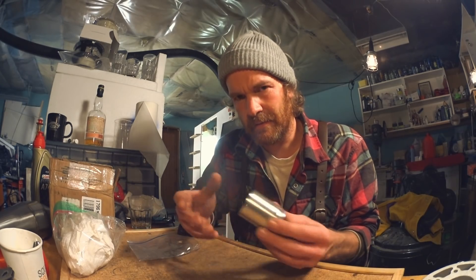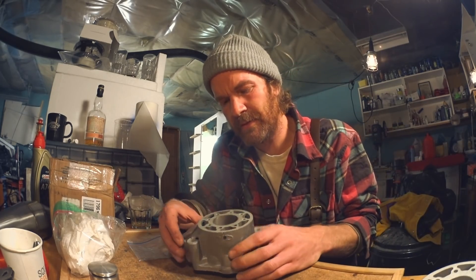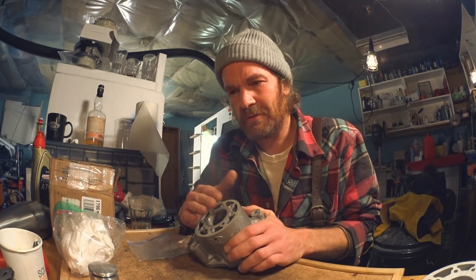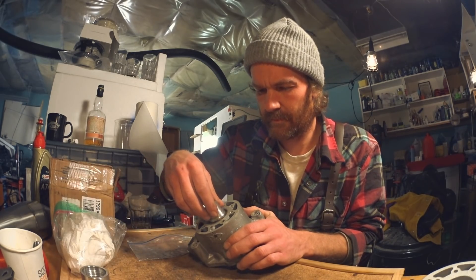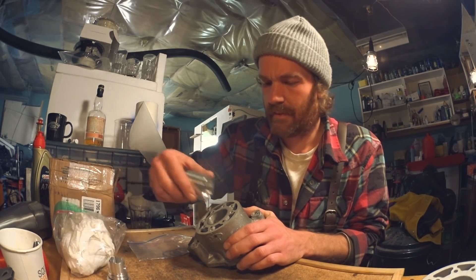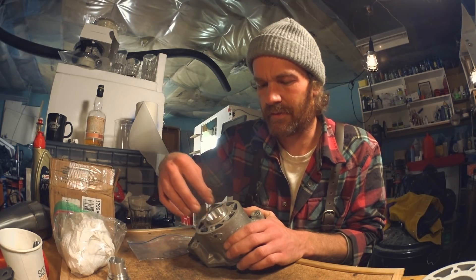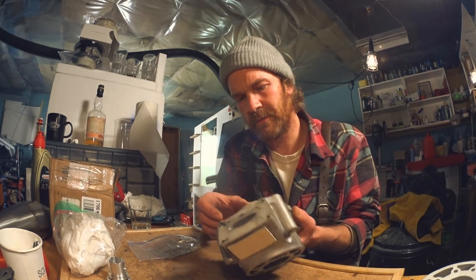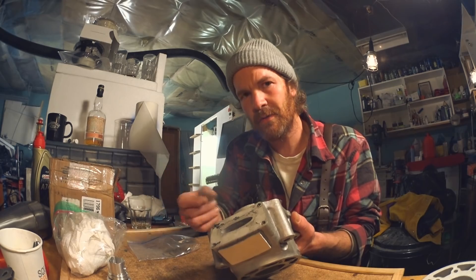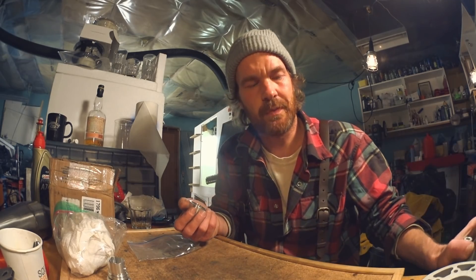Really looking forward to testing with this. The honing plates haven't arrived yet, which is kind of a bummer because I really want to just hone the cylinder now and test the pistons to see how they perform. We're almost to size - it's a slight bit tight down at the skirt, obviously, because it's widest at the skirt. So it's just a little bit of honing. I really would like to do that with the pressure plates, which are stuck in Chicago. Might just hone it without the plates and plate this and hone that with the plates.